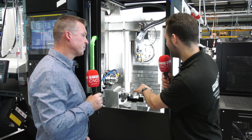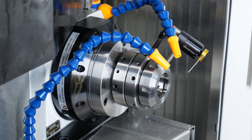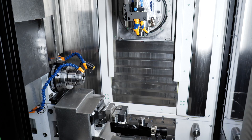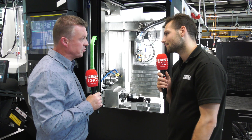So what's the back working unit? So you have the A-axis — this is the axis where the bar will arrive — and you will have the back working vices to recover the finished part after separation from the bar, to finish phase six, and to get the finished part on the spiraling chute.